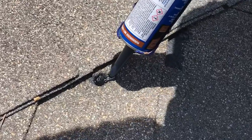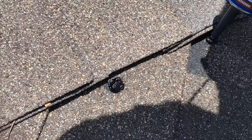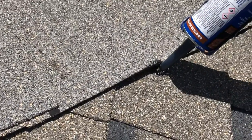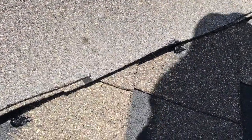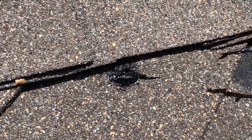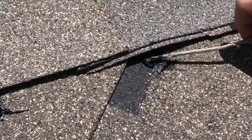So you put a little bit of roofing tar on top of these, and for the added touch — because what you don't want to see is black little spots on your roof — take and spread those out just slightly, make sure you're covered. Good, whole nail head, that's good.